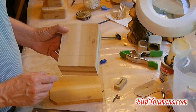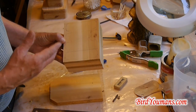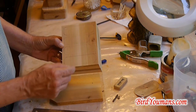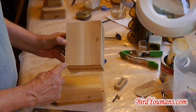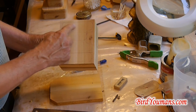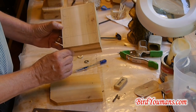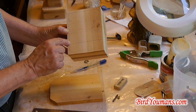When you're cutting a bandsaw box, you've got to plot your best direction, because the blade has to keep going forward. You've got to be careful because you're going to use these voids that come out — that becomes your drawers. My direction plan on this is to come in from right here, go around, come up, go around. And then once you're done, you can back your saw back down that channel. You'll have a sever right here, here, here, and here.